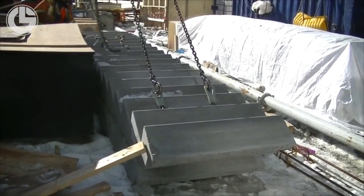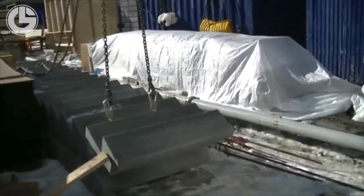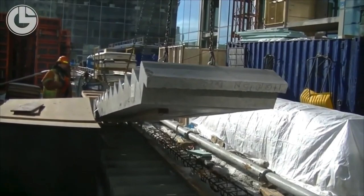A worker alone can attach each unit into the hoisting equipment using fleet lift ring clutches. The precast stair is available with width up to 78 inches wide and height up to 28 inches high. It can be used immediately. No lengthy curing period or complicated filling of steel pans is required.